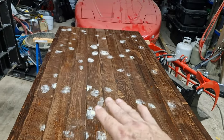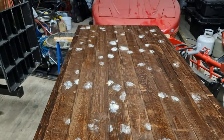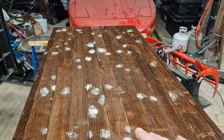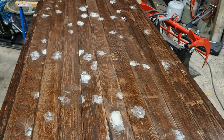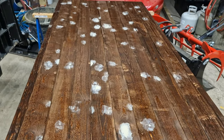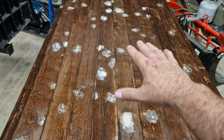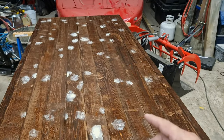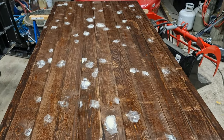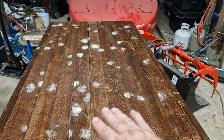And we did stain the wood first because we were worried about making sure that it was down in these grooves. It's not a poly, so the wood putty will stick into the wood. Plus, it's actually very grainy where this all is. It's a lot of mill marks and stuff like that that once we sand it and put the stain on it, they're going to be the dark spots that set this door off because it's a real knotty pine. Most of this is knots that were in the grain. And we wanted to make sure that there's no place that if water hits the door, it runs and gets stuck in it. So we filled it with the putty.